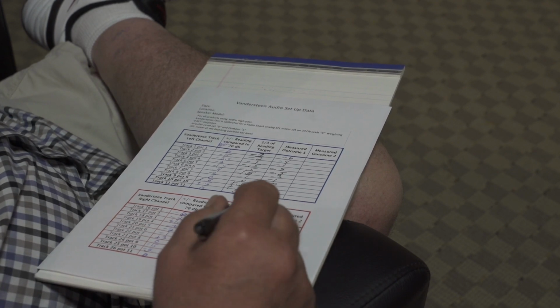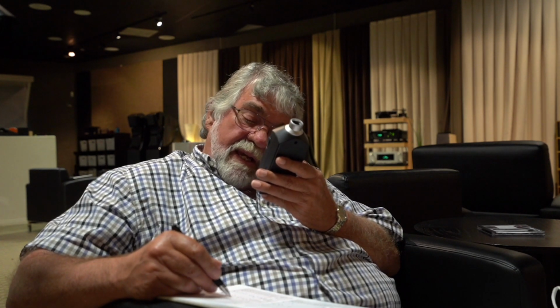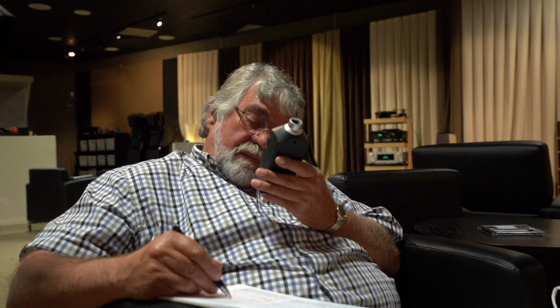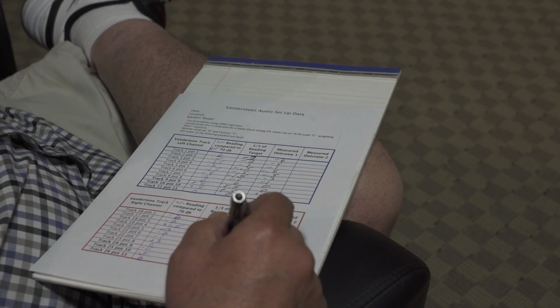We started that at +2, so by adjusting the first 2 pots, we've created a peak there we didn't have in the original room, but we still got to the target. Let's play track 19, pot 4. Playing track 19. Up. And we end up there at -3.